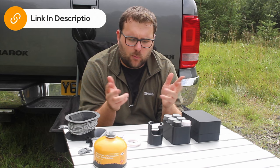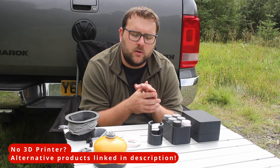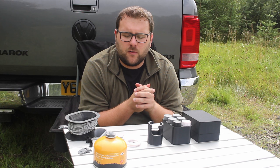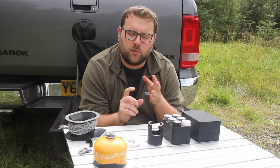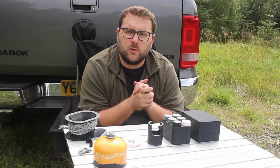I've used black, white, and grey so far and I really like that filament in conjunction with my printer. Even if you don't have a 3D printer or aren't interested in 3D printing, please do stick around — there are products here you can buy off Amazon, which might just be a little more expensive. For everything in front of me there will be a Thingiverse link, the time it took to print on my Ender 5 Pro, and the amount of filament used. I used a 210-degree hot end temperature and a 55-degree bed temperature, and I've had no issues with that whatsoever.